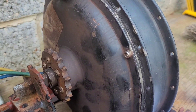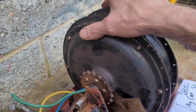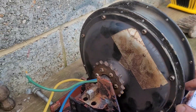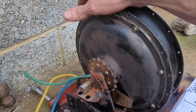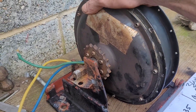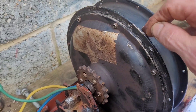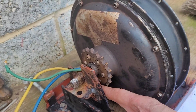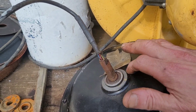I think the thing about the 3kW motor is the juice is definitely in there — the power is in there. But the turbine will either need to be taller, 20 feet taller, or have bigger blades, or ideally both. Because it's only got a 10 foot rotor, and a 3kW axial flux would have a 20 foot rotor. So I think this may go to another project, and we'll just carry on using this one, which I was perfectly happy with.